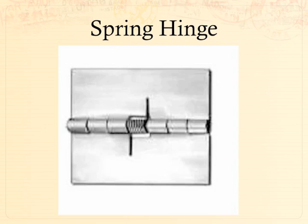A spring hinge is similar to the cafe hinge but only has one barrel with a spring. If you let go of one side, the other half will flip shut. These are commonly found on old screen doors where instead of a door arm that slowly closes the door, it will spring or slap the door shut. They can be used in other theater applications — if you need something to close quickly, close on its own, or pop in the air, you can attach them to just about anything and pull a release to give spring tension.